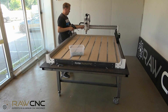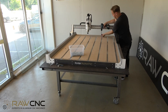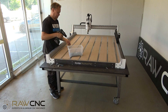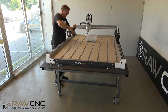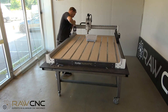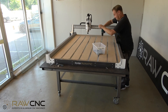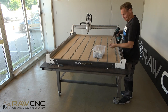Now you can attach the consumption table itself. Start from the back. Since we have a nut at the back, I first use a regular M4 screw and then 32mm self-drilling screws for the remaining holes. You can pre-drill the holes through the MDF boards but let the screw drill the holes through the aluminum profiles. If you have an extended machine, you must pre-drill the aluminum profiles using a 3.5mm drill and longer screws, usually 40–45mm long. When the old table wears out, you can easily replace it and use the same screws.